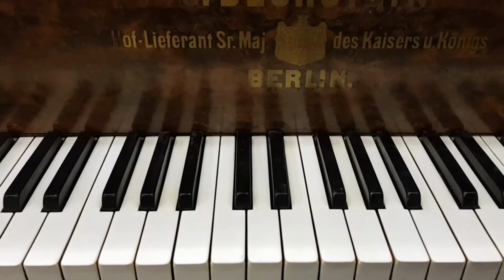And then if that stays a long time like that, this fades and the underneath doesn't fade, and you have a huge fade line. You can't really see one on this one, but you do get fade lines on pianos. We've shown many videos with those on. So that's an issue, really. If you do have a polyester piano, or in fact any French polished piano, have the lid down sometimes, have it up sometimes, vary it so that it fades evenly. But this is wonderful veneer.